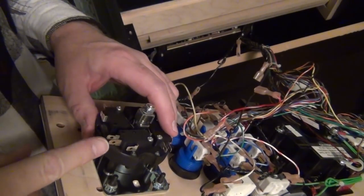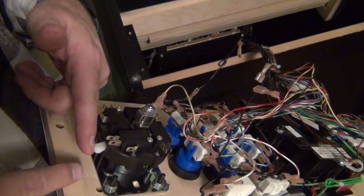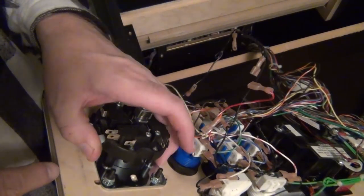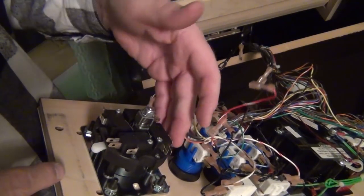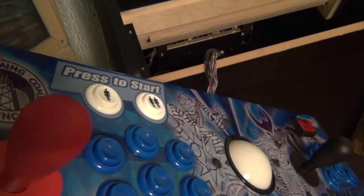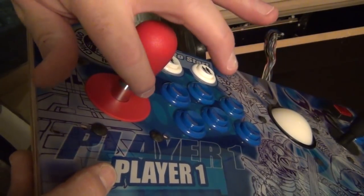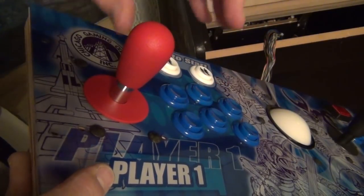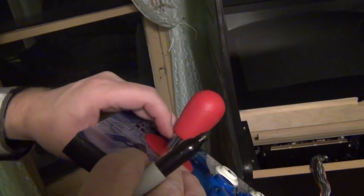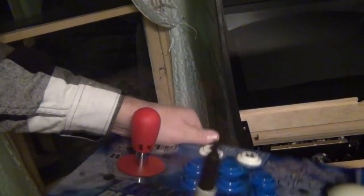Here's another install tip: this lever shouldn't be on the side facing the mounting bracket, because it can just hit it. Even though it has just enough clearance, it's not enough — you could break it off taking it in and out. So rotate the whole mechanism so the switch lever is on the inside with more clearance. And as a last pro tip: once you know you've got it orientated the way you'll finalize it, put a little '4' on the back side of the handle so you can quickly glance and see you're in 4-way. I'll put an '8' too, so you know which way to rotate to switch.